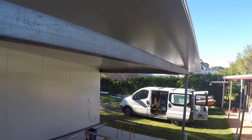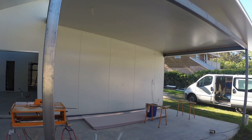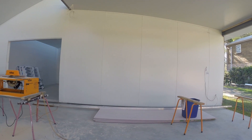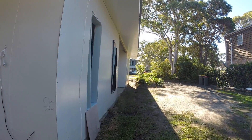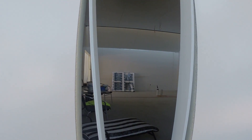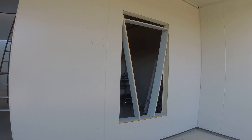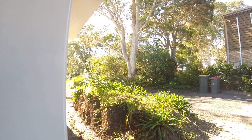Now that the sheeting is done, we're into doing the windows. In this particular house we're going to be doing all aluminium windows from Trend Windows — whoever your local supplier is, they're probably just as good. You can't really get standard reveals with the windows because of the thickness of the SIPS panels, so I've had to make up special wooden batons, or wooden reveals, for the windows to fit them into the house.